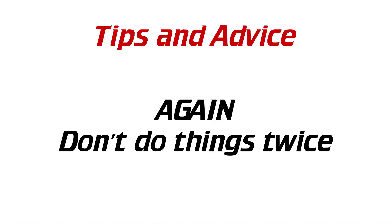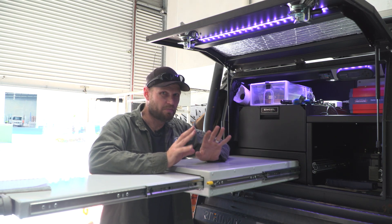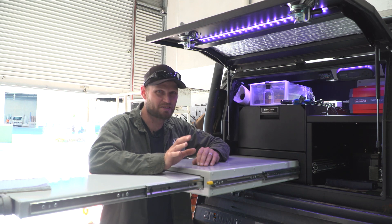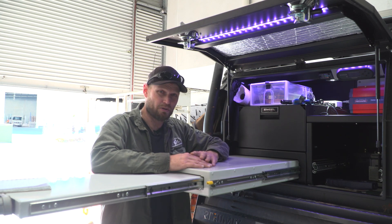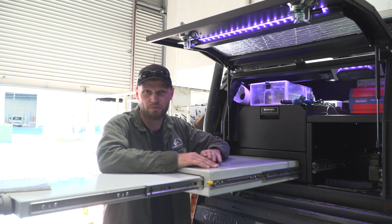Things get confusing when there are a lot of wires, even with a drawing. To keep control: do one switch or plug at a time, and put masking tape on that wire labeling what it's for — fridge, light switch, whatever. Then when rummaging around to connect everything later you know exactly which wire goes where. Also: when you've hooked something up, before closing all the panels, check that it actually works first. I had a couple of lights that didn't work because I'd mucked something up and had to pull everything apart again. Don't rush.